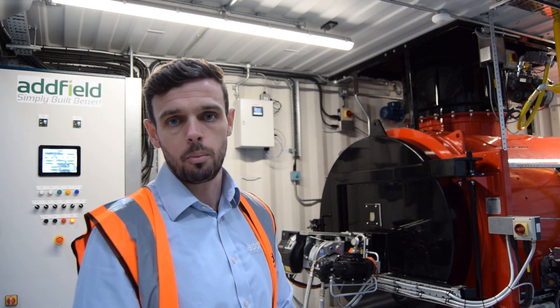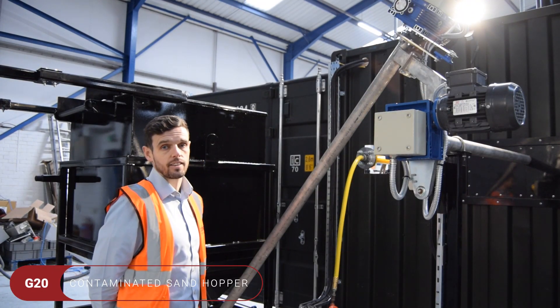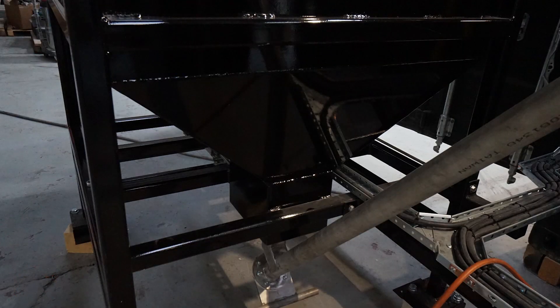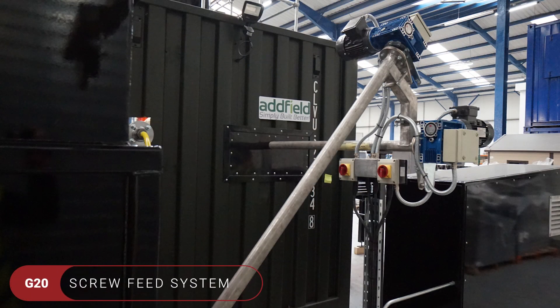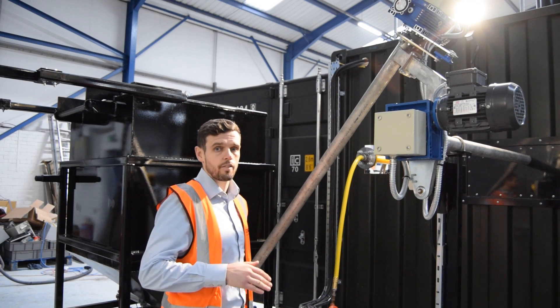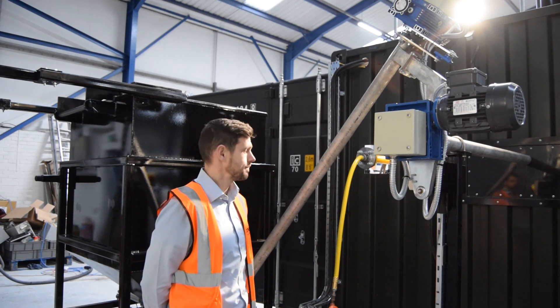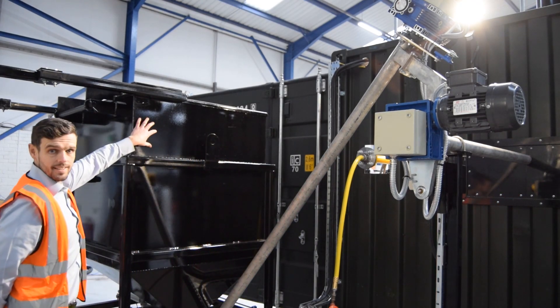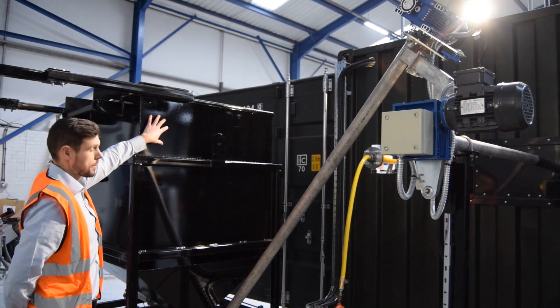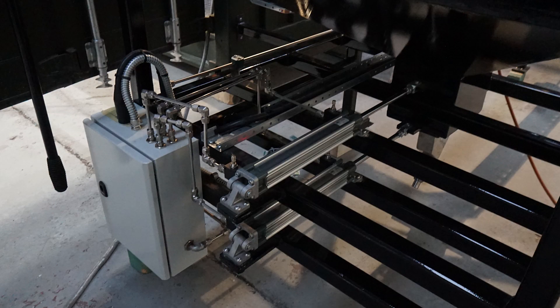Let me show you the system a little bit closer. At the rear of the incinerator is the hopper for contaminated sand and soil. This is deposited into a screw feed system which brings it up to the entry point at the back of the incinerator. The incinerator has a sloped floor to ensure greater retention of the sand and to ensure full treatment of the carbon burden within the sand. Waste is deposited into the top of the hopper and sliding floors allow constant entry of the waste into the screw feed.